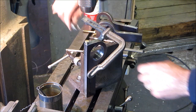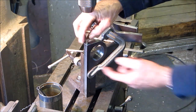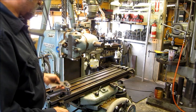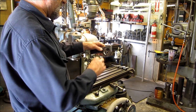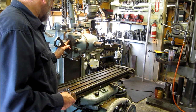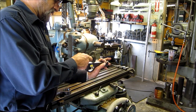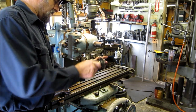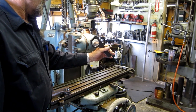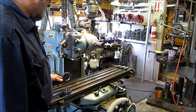We got the first one, and we're going to go ahead and duplicate that with the other two, then go in with the slip mode. We finished our bores in these parts and our tapping. Now we're going to swing this head around and run this wheel cutter to make a slit across here so that we have a gap for the clamping grip of these bores on a two-inch shaft.